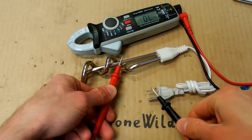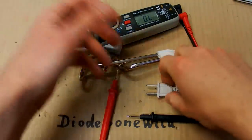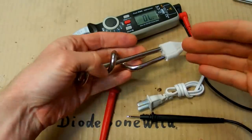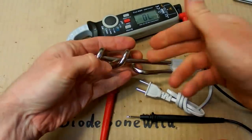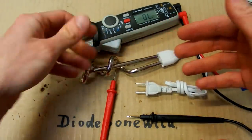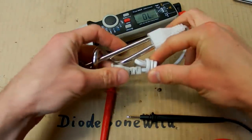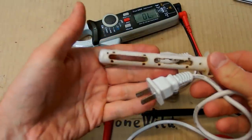This one is isolated. But as you can see, there is no ground connection — it's not grounded. So there is just a single layer of safety, not two. With a ground, even if the isolation fails, it's grounded and it will trip the breaker, giving you two layers of safety. This one is not compliant in Europe because it has to have two layers of safety, not just one. And that other one has zero layers of safety.